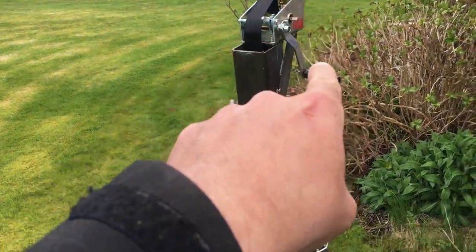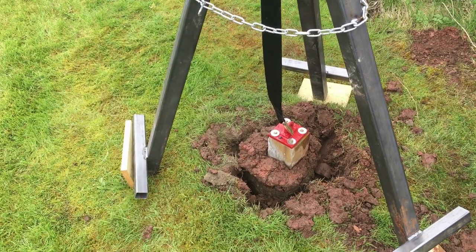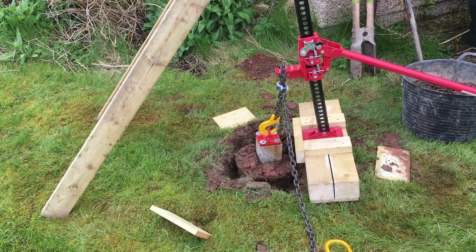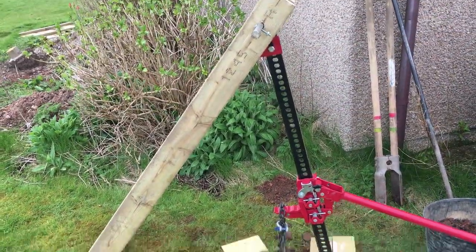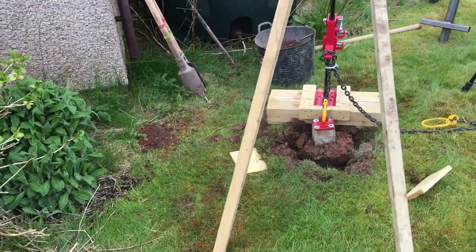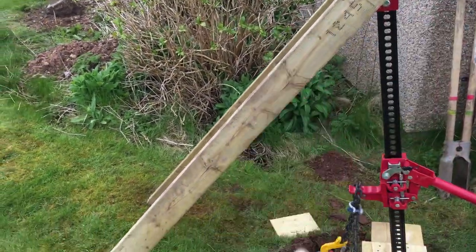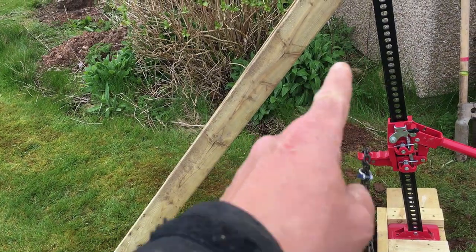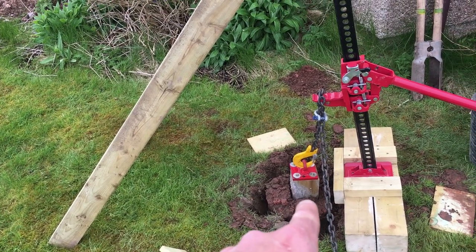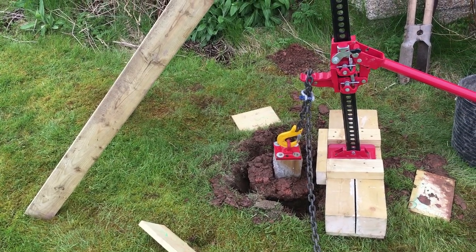It's been putting so much pressure on that winch — it just does not want to come. I think it's suction more than anything else that's keeping it in. So what I'm going to do is hook up the farm jack and do it the standard way that I would normally do it. Sometimes the old methods are the best. I've got the farm jack set up with a couple of four by twos — hopefully we'll get the jack in action and pull this post out. I'm a bit disappointed the winch didn't work, but I'm pretty sure the jack will struggle as well — there's a lot of suction there.